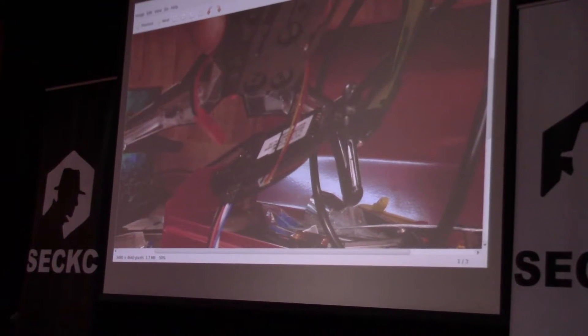What did they do right, though? If you look at that picture really closely, they saved some money. The drone itself receives radio commands from the transmitter, and when you click picture or video, it sends those commands over a UART — those three lines — to the drone view. There's only three lines, and since the drone powers the drone view, two of them are power and ground. The other one is a UART, but it's only half a UART. There's no way for the drone view to send data back to the drone, which means that accidentally, by saving a fraction of a cent, they've built a data diode. This is actually a really awesome security feature purely by accident — it means we cannot crash other people's drones physically.